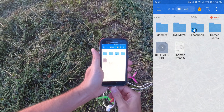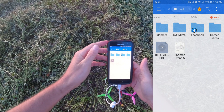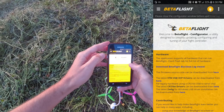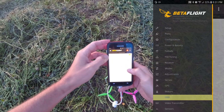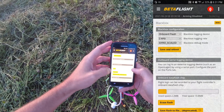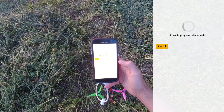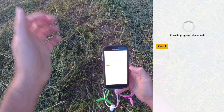If you want to clear your flash for another log, just unplug and replug your OTG adapter. Wait for the Betaflight app to open up, hit close, hit connect, hit close again, and go down to your black box. From there you can hit 'Erase Flash,' and that will erase the flash on your flight controller so you'll be ready to start the next flight. You can obviously download that one too and just keep going.